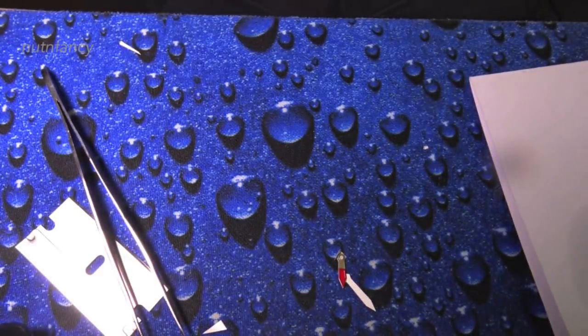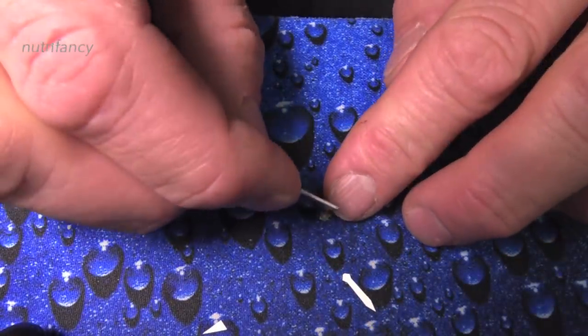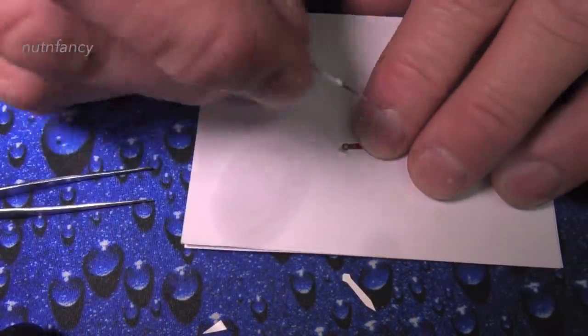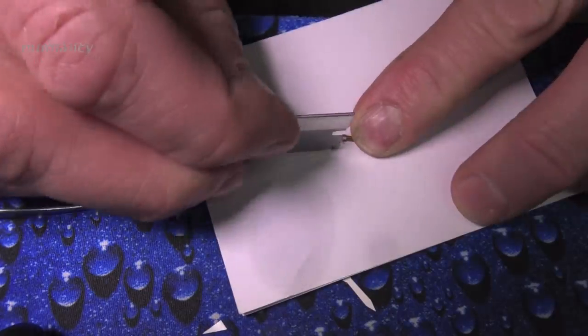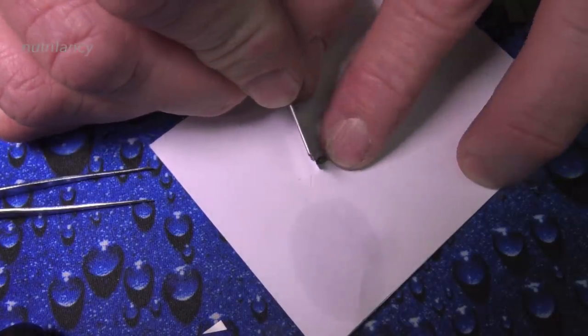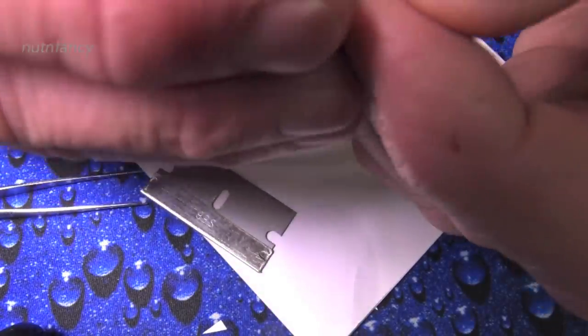Here's the color — I like matte paint. The seconds hand is in a vise via a toothpick holding the putty, which gets it up in the air so I can spray it. Now it's drying. One of the hardest hands to tape are IWC-style hands — when they come to a very sharp tip it makes it difficult for the tape to look good. Here's our initial cut on the minute's hand.